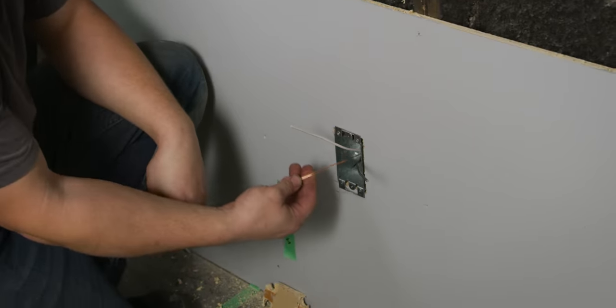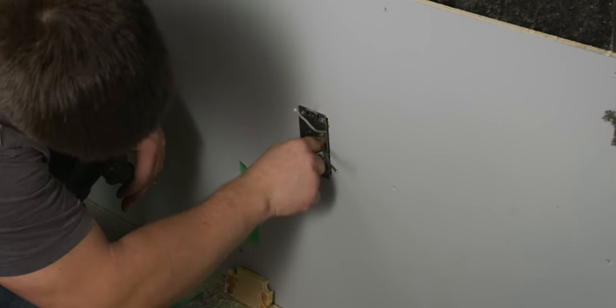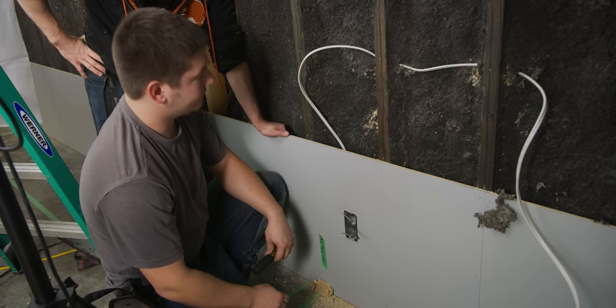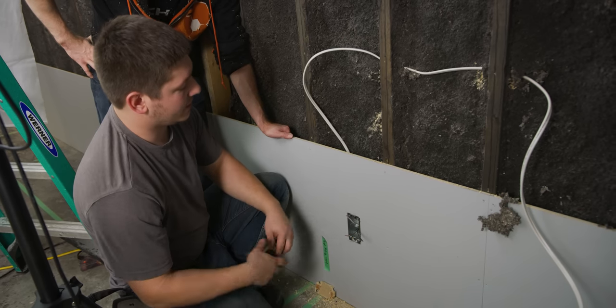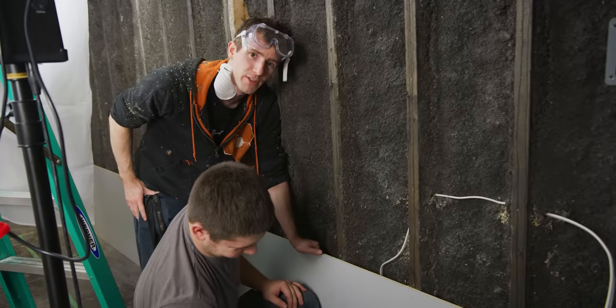Here in Canada, this is the bond. It's either bare or it's green. There's actually a screw at the back of the enclosure. So we can take that, wrap it around that screw, snug it down. And now this is bonded. Oh, so all the Europeans were concerned that we just don't care about safety, basically. That nothing was earthed, yeah. So we call it the bond here. In Canada, we have lots of earth, probably more than you, unless you're in Russia.